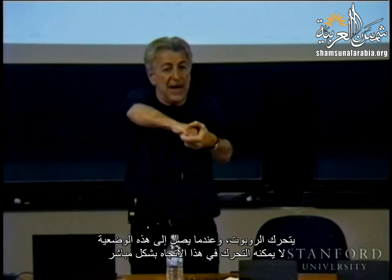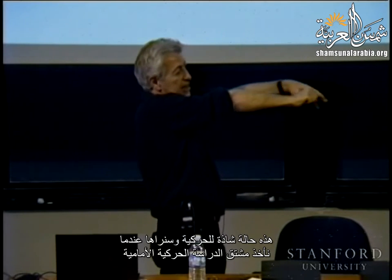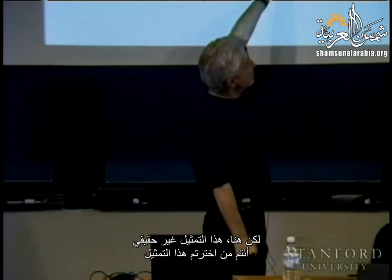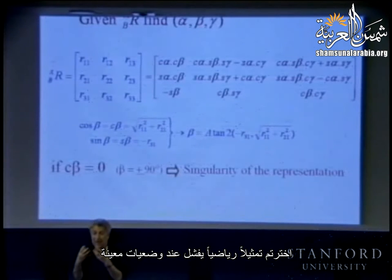is moving, and when it reaches this configuration, the robot cannot move immediately in this direction. It's locked in this direction, like this. This is a kinematic singularity, and we will see this when we take the derivative of the forward kinematics. But in here, this representation is fictitious. It's only you who selected this representation, a mathematical model that fails at some configurations. So